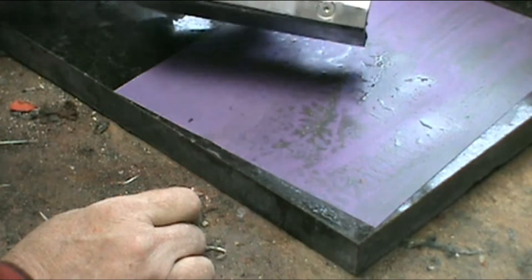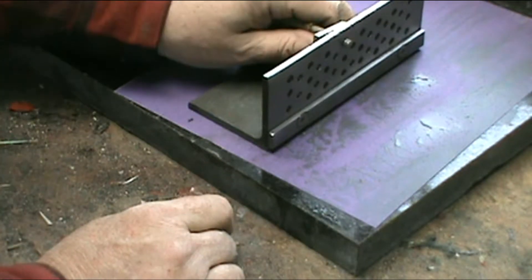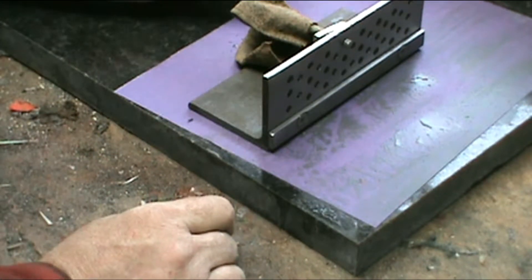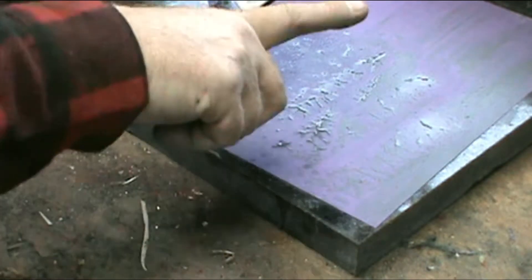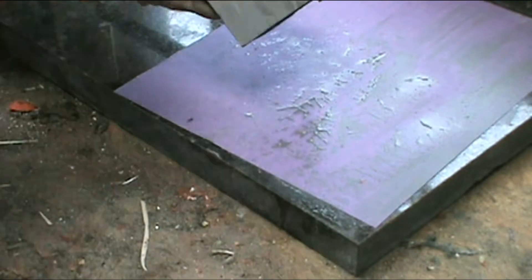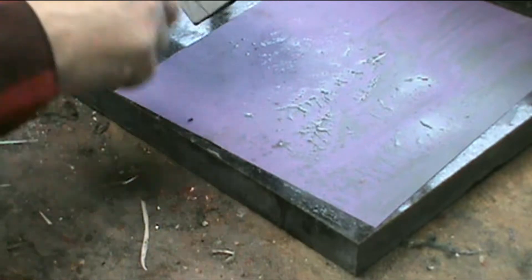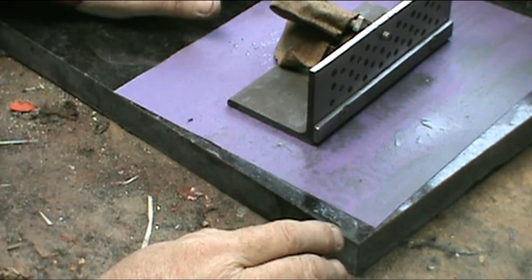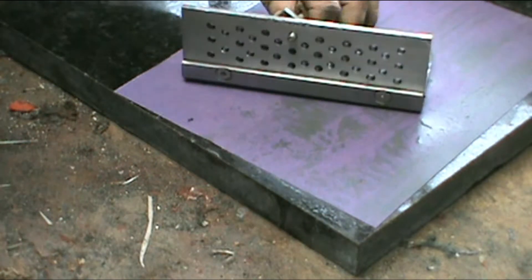Anyway, I added 15 or 20 new holes and put a ledge on there so I could hold my knife straight. I'm just lapping this on the granite block to make sure it's square. I did it yesterday with a file and a mill bastard, then did a little 120 on it. Now I'm just lapping it here with 220 — that's as far as I'll go. This is what I was needing the tap and die set for.